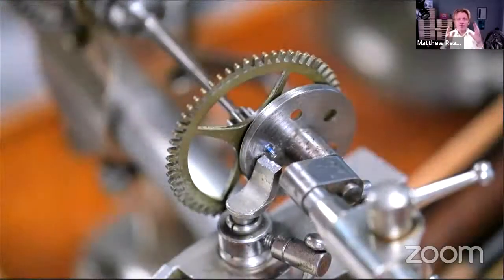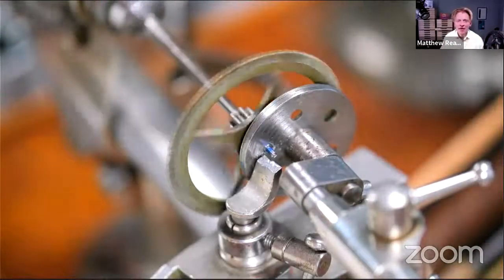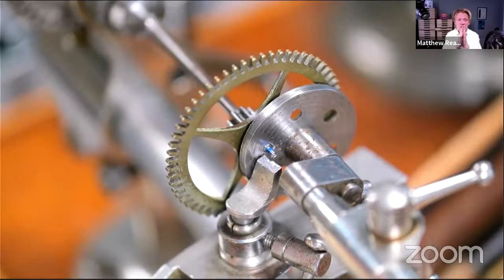Right, so I'm just going to true it up. Okay, so next part of truing it up. This pivot's obviously, I jammed it in the hole, wobbling a little bit, but hopefully sound without any glue on there. If you put your graver flat against it to turn it true, you'll never turn it true. All that'll happen is that it'll get smaller and smaller in diameter, but it'll continue to be wobbly. So what you have to do is get a very pointy graver and jab that in, resting against the T-rest, several times moving along. So you get an incredibly rough surface, but it's concentric.